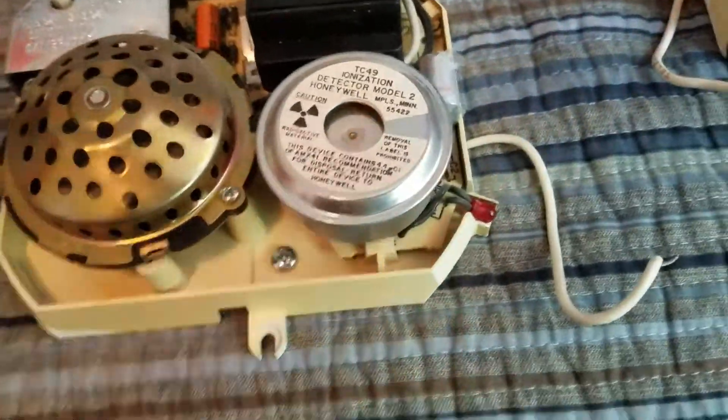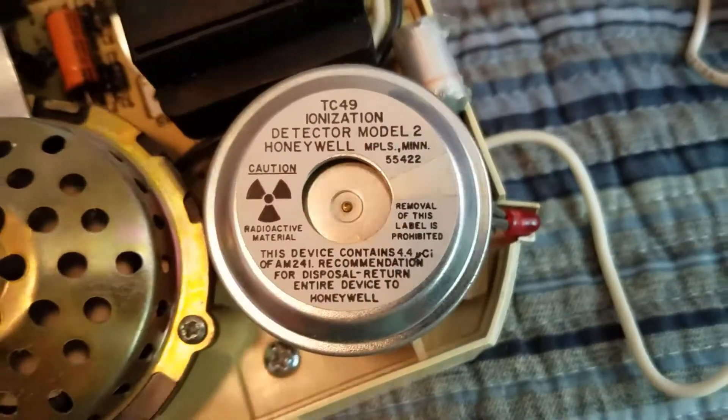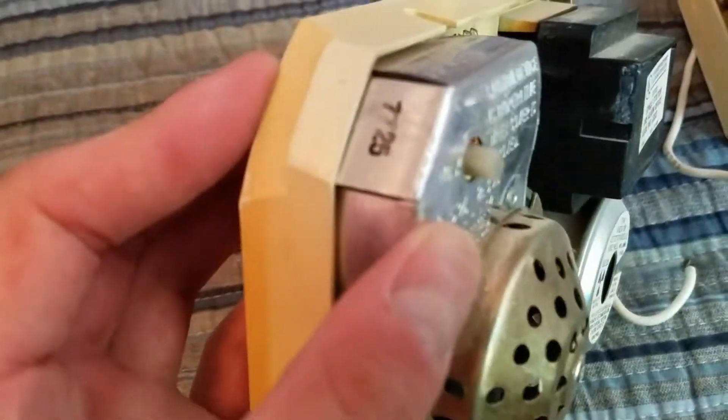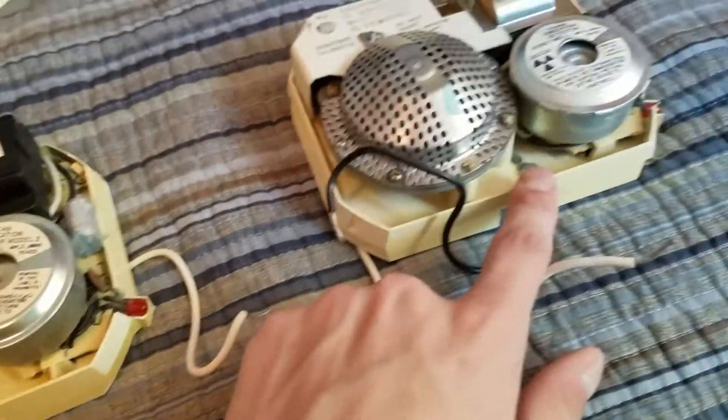The horn in this one is an Edwards horn, just like the one in my childhood unit, which also has an Edwards horn. However this one's label is different - this one is labeled 'TC49A ionization detector model 2,' so this one is known as TC49 model 2. But if you look on the side of the circuitry cover where the other label is - the model information, voltage, and everything - it says TC49A 1005. So I'm guessing this is essentially just an earlier version of the TC49A, which is weird because why would it say TC49A 1005 on one label and just TC49 on the other? The date code on this one is 77, and the date code on the other one is also 77, so this one was probably made not too long after that one.